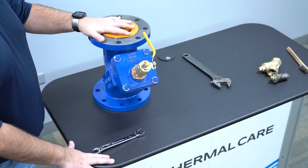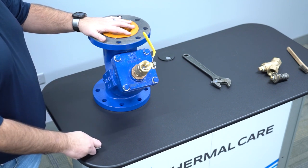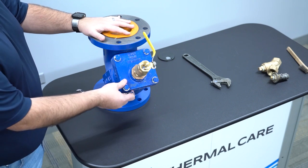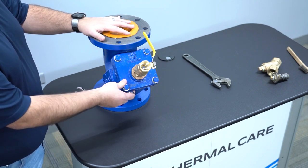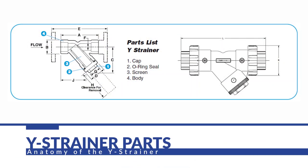The Y-strainer located on the inlet to the chiller system — so the evaporator — on the central chiller systems is going to look a lot like this. This is actually a large evaporator that this is going to be providing filtration for. Maintenance on the Y-strainer on the larger central chiller systems.